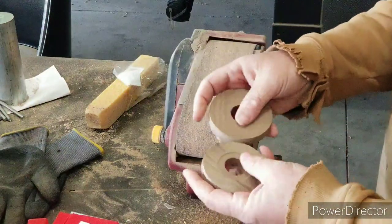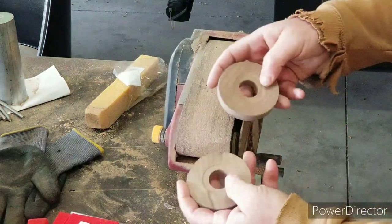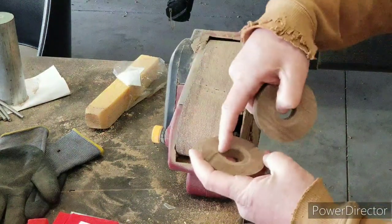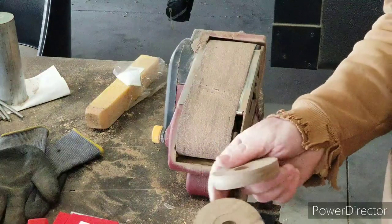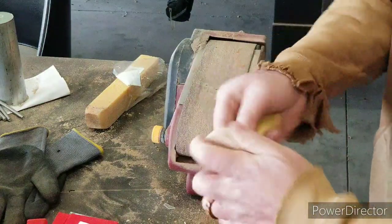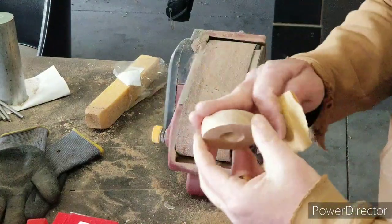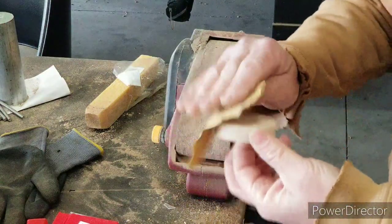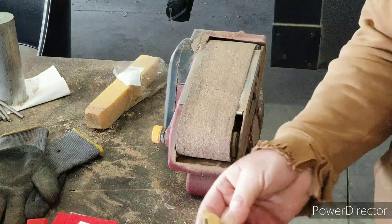These are the two I'm not very happy with — this one you can really see how off-center it is. I'll probably keep this one or just give it away for free. Since I had to sand it down so much, I'll have to hit those with the forstner bit again and hopefully it catches the rim without walking all over the place. I'll do that off camera. Then I'll just take some sandpaper and knock off the edges — they're not really sharp anyway, but it just makes them feel a little better. Then I'll show you the holes on the inside.